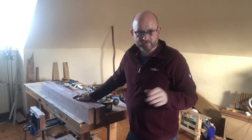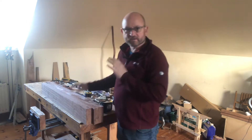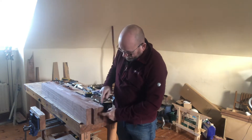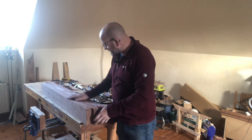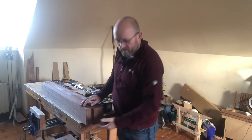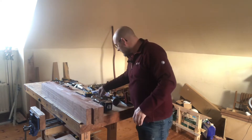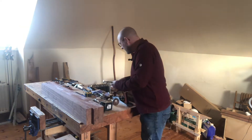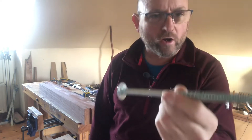The first thing we need to do is put the three pieces together, which is what I've done — screwed together. These are not fully planed up; I have the faces, these two faces which meet together to be glued — they're planed — and we square up the top edge and the bottom edge when the vise is together. So how am I going to go about making a Moxon vise?